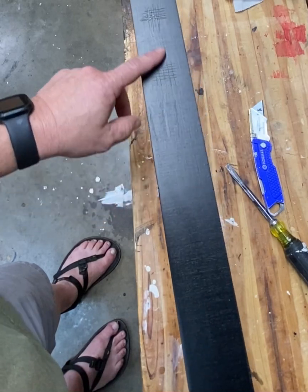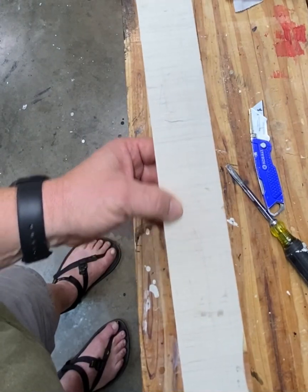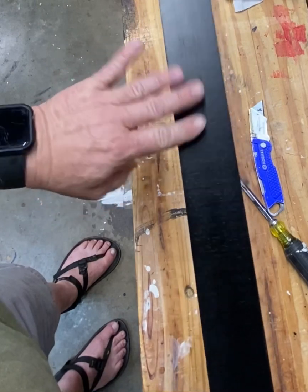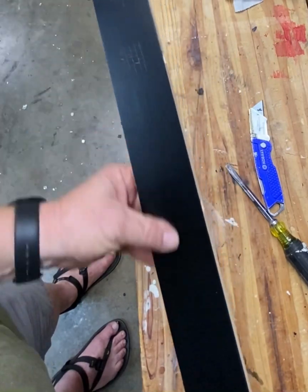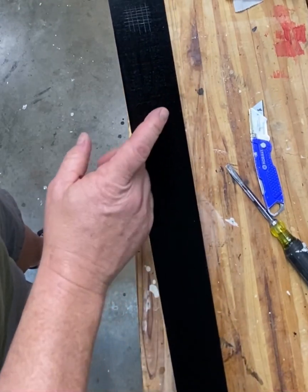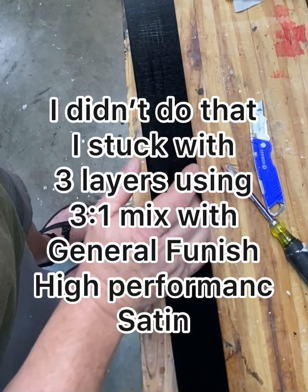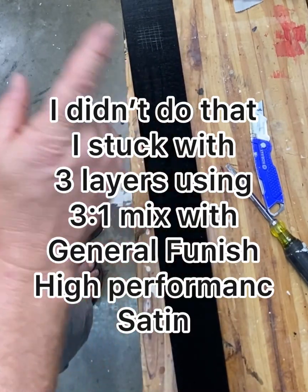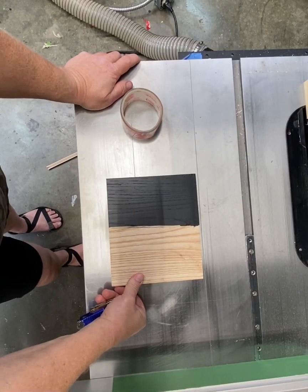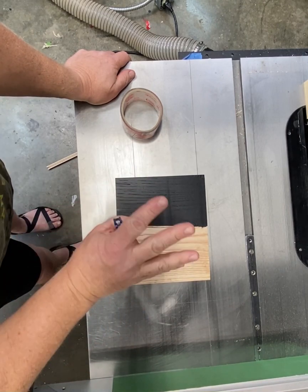So from what I can tell, my polyacrylic with India ink mixed in — three layers on plain plywood — gives me pretty good results: good coverage, pretty even all the way across. I would probably stain the wood first before putting on two layers of the polyacrylic, then finish with just a clear layer. That plywood test was done at 24 hours of drying.